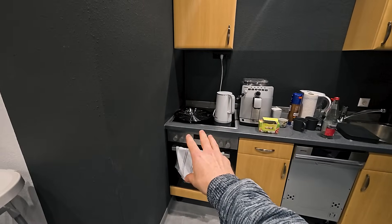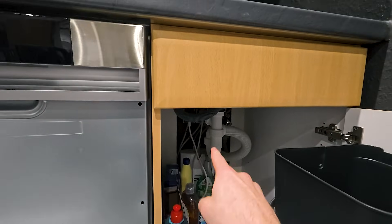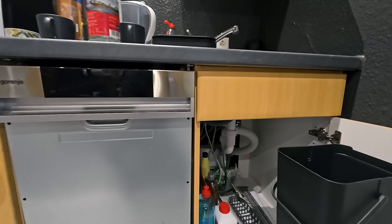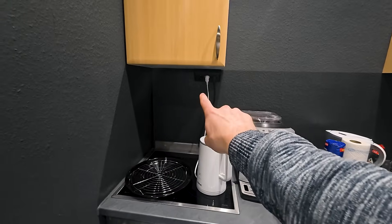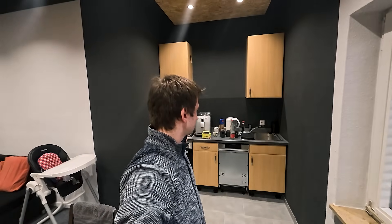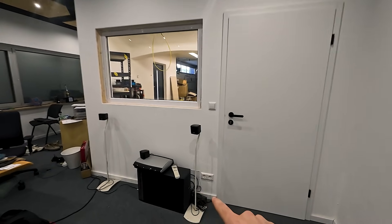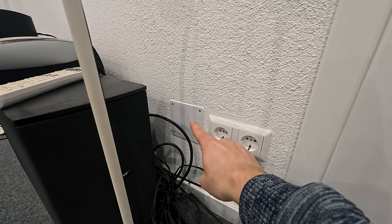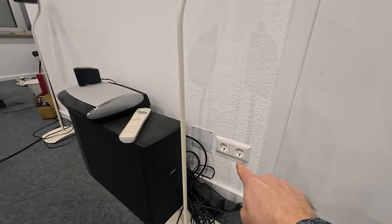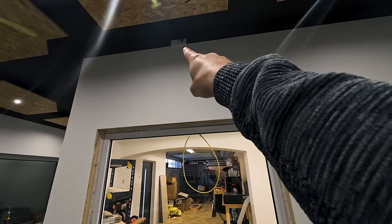In the kitchen we have three-phase for the stove, a breaker for the dishwasher, a breaker for the 3.5 kilowatt water heater which needs a whole single phase, and another breaker for the outlets where the coffee maker is hooked up. So theoretically we could fire everything at once at full power without tripping a breaker or a fuse — that never happens, but we did things properly. The other cable comes up into the office wall we built, and there is a mini distribution for all the outlets we installed in the wall, and that's also where the networking cable comes up.